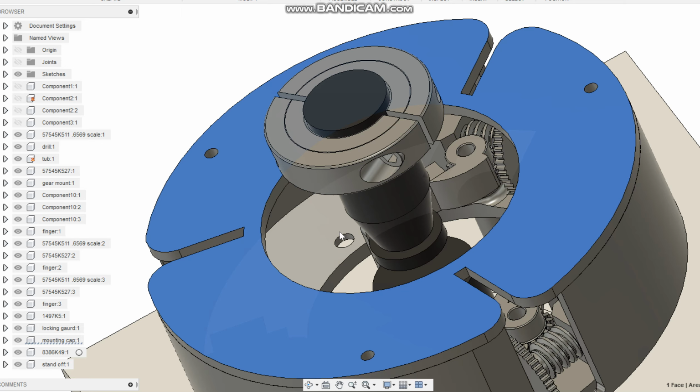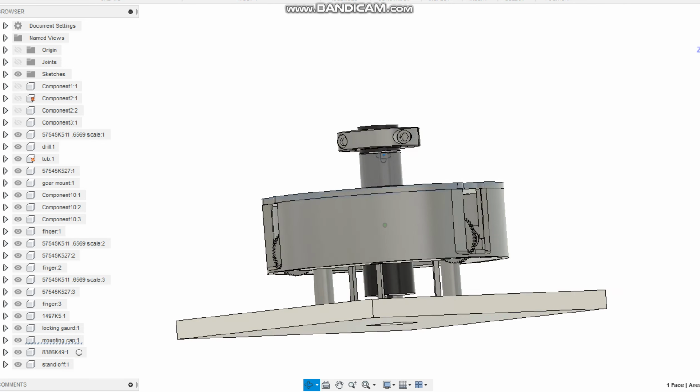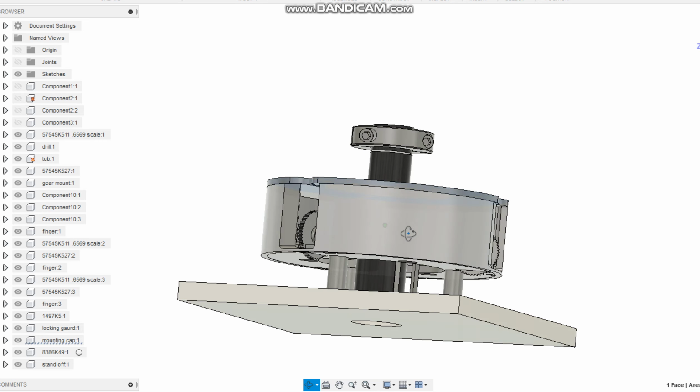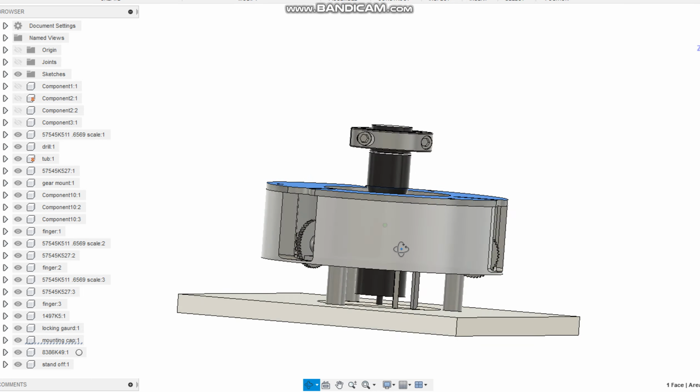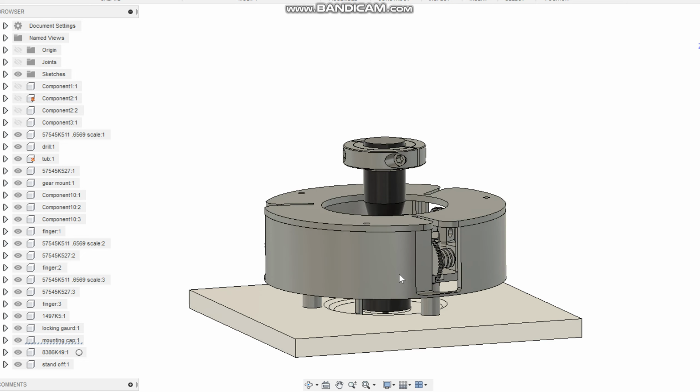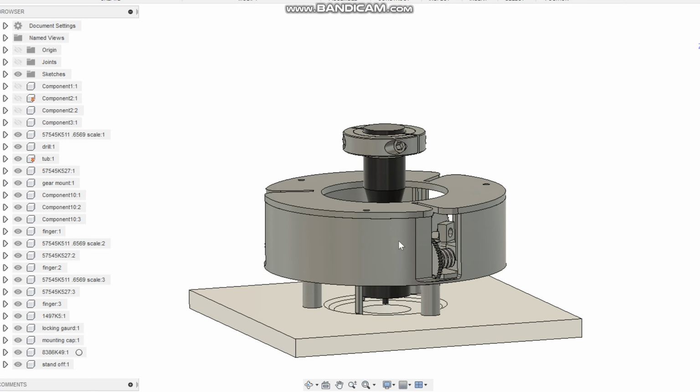And in the meantime, I've got enough of a design now to get you a ballpark price, because that may be another sticking point. I don't know. But that's it. That's an all mechanical tub drill centerer that requires no air inputs or anything. And it would prevent somebody from pushing this down unless those fingers have verified mechanically that you're in center.